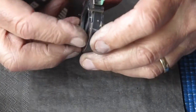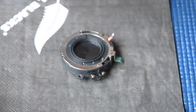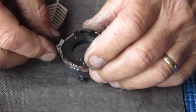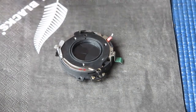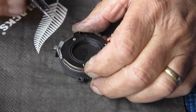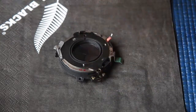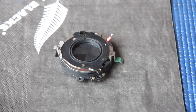That pin through in the right position. That looks good. Suspiciously easy. The retainer. Just click that arm out because it catches in a notch there. And you want to make sure it's in the notch, or at least on the edge of the ring, not trapped up behind it. Otherwise, when you do the screws up, something will get damaged.